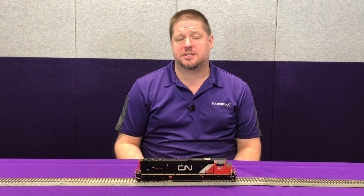It also helps you to enhance certain features of the speaker that you're using. So if you're using a smaller speaker, if you shift the pitch up, then the higher frequencies that that speaker can reproduce now come through more cleanly. Same thing if you've got a speaker that has the ability to produce lower frequencies, you can shift that down and really enhance those low frequencies.